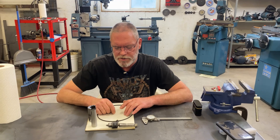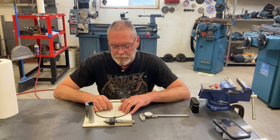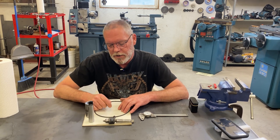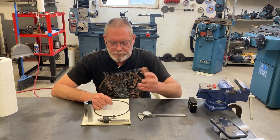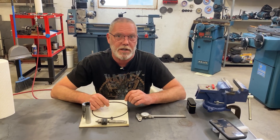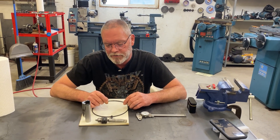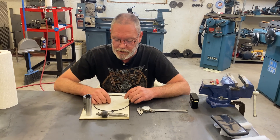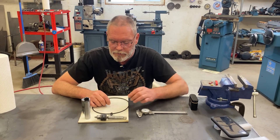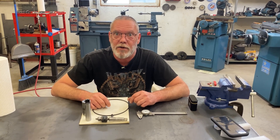So we're going to do two things today. We're going to see about sharpening this guy up a little, and I'm not sure how it's going to work because it's a two-flute drill and my chuck has three teeth. Normally putting twos and threes together is kind of a bad idea, but we'll run the dial on it — the dial never lies — it'll either work or it won't. If we can sharpen it we will, and if we can't get it to run true enough then we're going to drill a hole with it and see how that works.